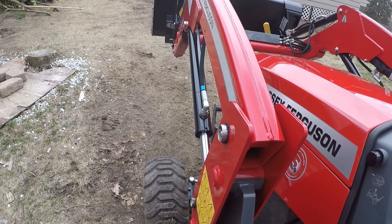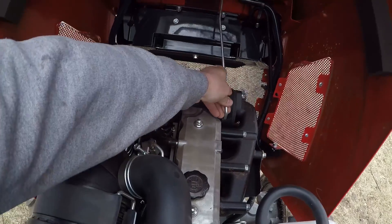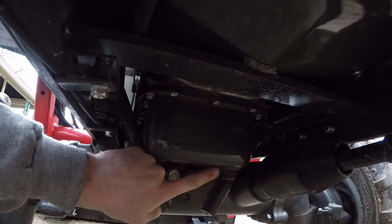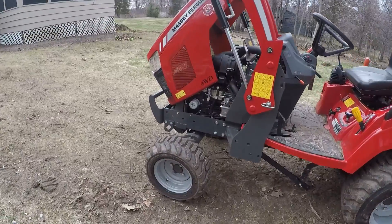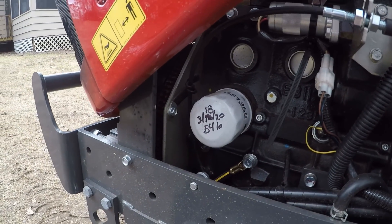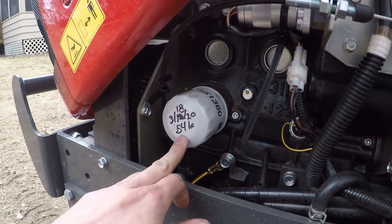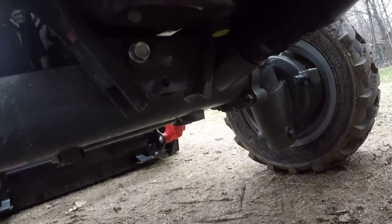In order to change the filter, I recommend raising the front loader on the tractor. Once that is done, pop the hood and secure it with the hood latch. Move the oil fill plug to allow for better drainage. Locate the drain plug on the bottom of the pan and drain the oil. Once this is complete, reinstall the plug. The oil filter is located on the left side of the engine. Remove the filter — be sure you have your drain pan underneath the filter as it will drip oil. Reinstall the new filter. I like to mark my filters with the date and hour so it is easy to see when it was replaced. Fill the engine with 2.7 quarts of 10w30. Once you have filled the engine, start the tractor and check for leaks. This will complete this step.